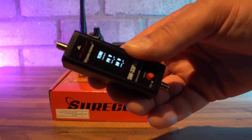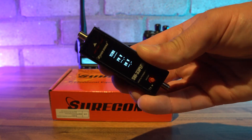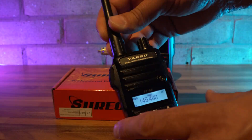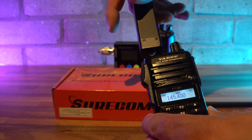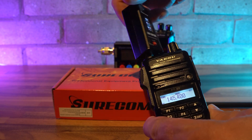I own a large amount of handheld radios and antennas, so this little device is perfect for testing and measuring output power from these radios. It's specifically designed for handhelds and has an SMA type connection at the top and bottom of the unit. It's small enough to fit in-line with most radios and simply screws directly into the antenna ports. Most modern transceivers have SMA male or female type fittings, so it's very easy to connect.